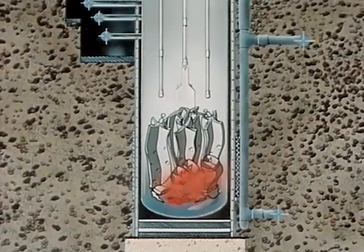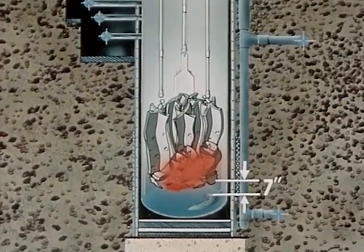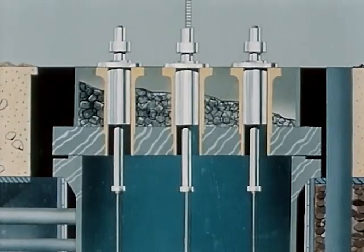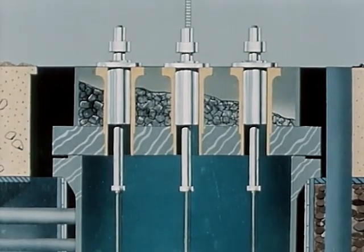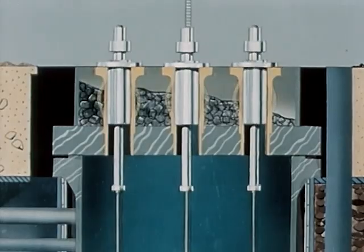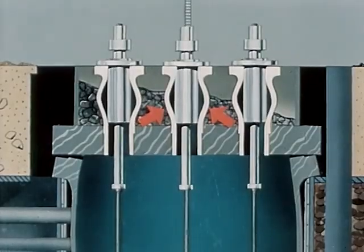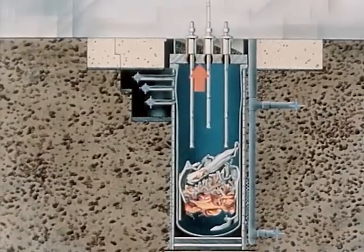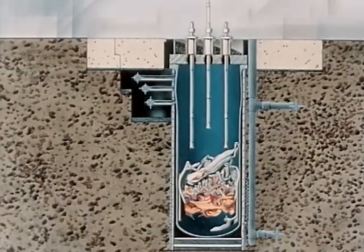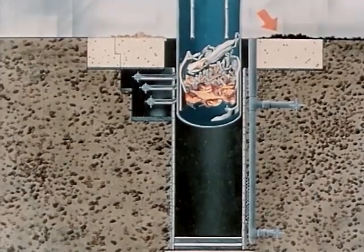While the water was moving upward, the core structure jumped, reaching a height of seven inches above its supports when the water hammer hit the head. As the water was decelerated upon striking the vessel head, the forces generated collapsed the shield plug guide tubes. It also deformed the vessel wall and the vessel head nozzles. Additionally, the momentum of this water as it struck the vessel head transferred its energy to the reactor vessel, imparting a vertical motion to the shield plugs and to the vessel itself. Some biological shielding material was ejected from its container on the vessel head.